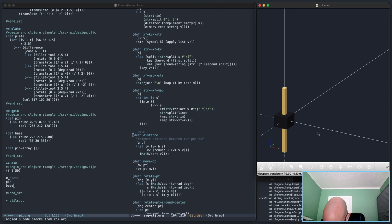So pin center to pin center would be approximately 2.5, which is close to what I'm seeing here. It's really boring to put on the screen, but you take your caliper and you just measure your stuff, right? And you get a visual on the screen here. It's going to be a bit finicky. It's not going to be exact, but you're going to have to use intuition as to what the exact measurements would be. And very often designers will use nice round numbers, right? So 2.5 is better than 2.431, blah, blah, blah, or 2.58. But it's a judgment call sometimes.